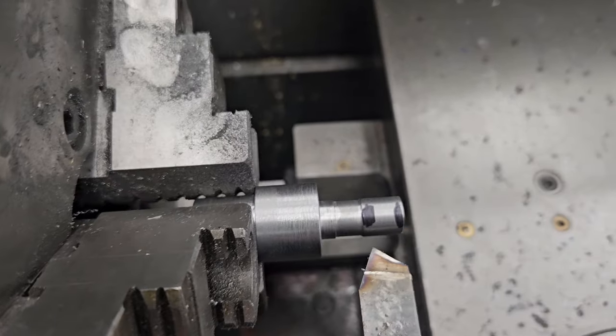All right, so I thought I was done, but I decided I'm going to add something else. Let me show you what I'm going to do. I made a line here. I'm going to add a line here and a line there just to make it look a little cooler, like the professional ones. Okay, I had more to go, maybe another 2 or 3 millimeters, but I kind of want to keep that small little shoulder right there. I'll do the same thing to the other side now.